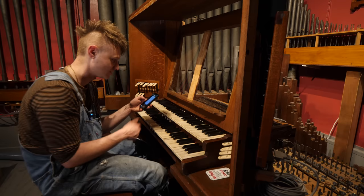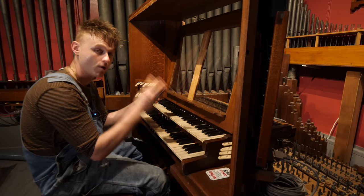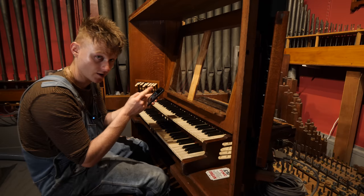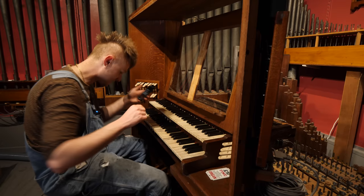Lembe mentions that he uses one buffer for the keys, one buffer for the stops, and one buffer for the pipes. Every time a change is made to the keys and or stops, the corresponding buffer is updated and the pipes buffer is recomputed to reflect the new configuration. The pipe buffer is then compared to the current pipe's configuration and MIDI note on-off messages are set accordingly to reflect the new configuration in the buffer. Oh my God, I just played a note there.